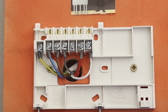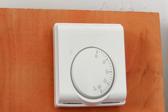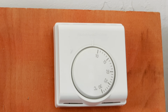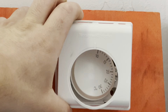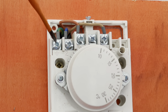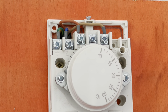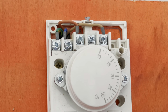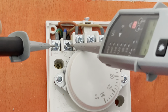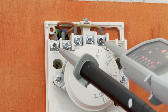This training rig is all Honeywell components — easier to work with and what I use on a daily basis. If you're at a customer's property there's literally a flat screw at the top, undo that, and the front comes off. It can look quite daunting but you've basically got earth, neutral, and then terminals one and three. Power comes in on one when the programmer is calling, and when it makes the switch it'll go back out on three.